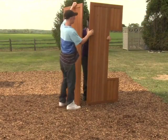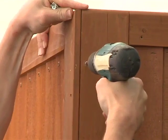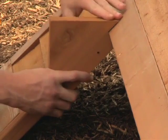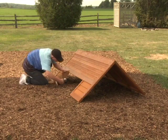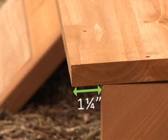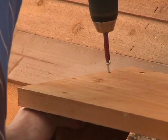Step 23: Roof Assembly. Fit the 230 front roof panel to the 231 back roof panel so the back panel overlaps the front and the inside angle is square and tight. Attach the panels together with five S15 wood screws, then attach the back roof panel to the front roof panel with five S15 wood screws. Fit one 232 transom side on each side of the gap in the front roof panel so the bottom is flush with the bottom of the panel and the notched edge of the transom side fits tight to the panel. Attach each transom side to the front roof panel with two S3 wood screws per board. Place the 233 transom roof over both transom sides with the angled edge tight against the front roof panel, making sure there is a 1.25 inch gap from the outside edge of each transom side to the outside edge of the transom roof. Attach the transom roof flush to the outside edge of each transom side and to the front roof panel with eight S15 wood screws.